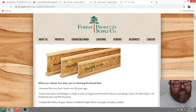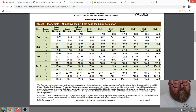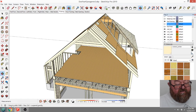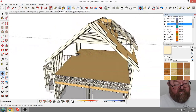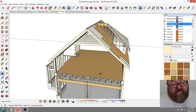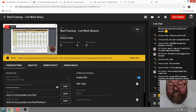So they're cool, and they're cheaper than floor trusses, and they'll span farther than 2x12s or any other dimension lumber. But you just got to remember these will deflect a little bit. I've actually used a combination of all of these things depending on the spans, and that's why I go through this exercise on every job. The best thing about it though is once I get to the point where I'm actually building it, it's in my head and I've got all the questions.